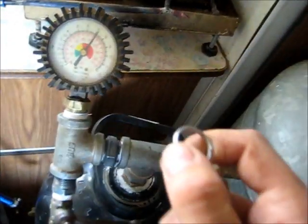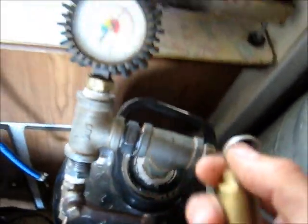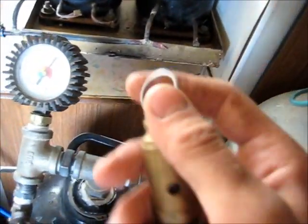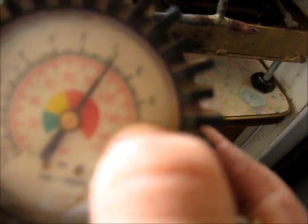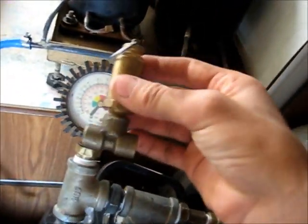Now after the 970 kPa it's calibrated to — that's like 142 or 143 psi — I don't need it that much. I might have to lower the pressure down a little bit. 900 is there, so 970 is about here. I'm going to have to calibrate this to 120 psi, this pop valve.